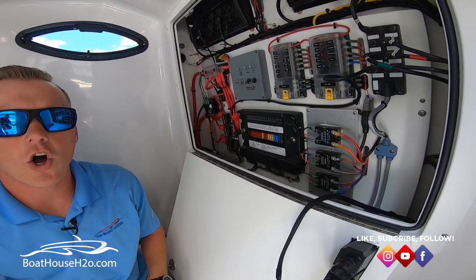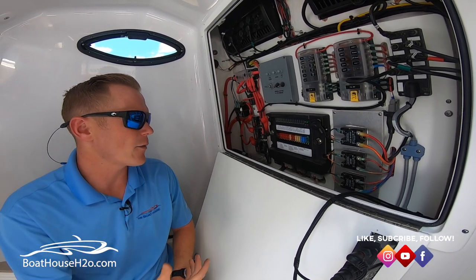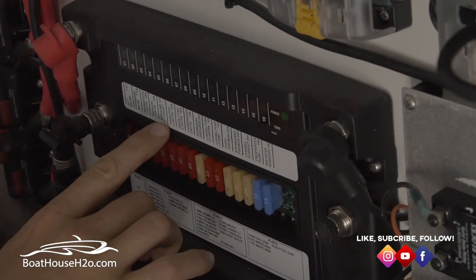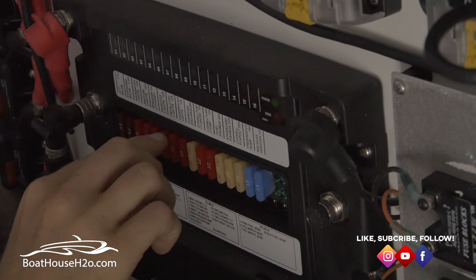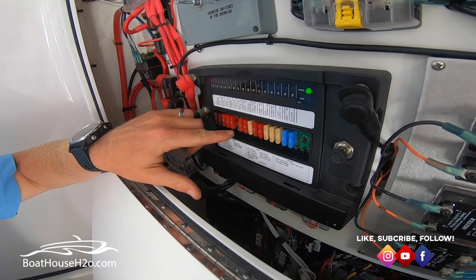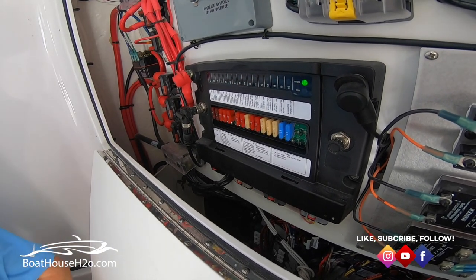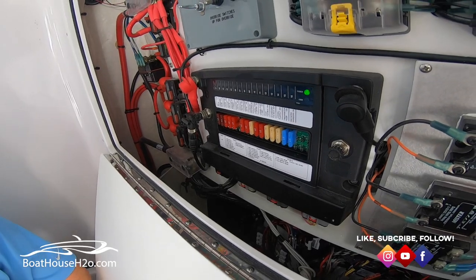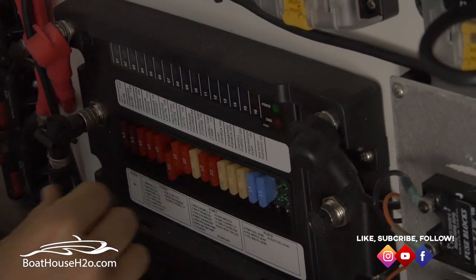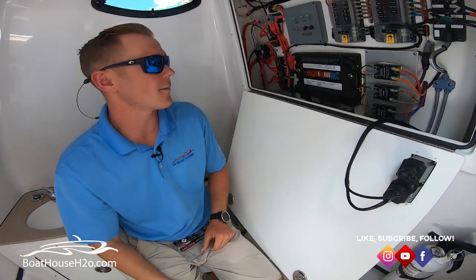Down below here, as you can see, you've got this Maximus DCM by C-Star. What that is is all of your switches that you see on that panel right here. So for instance, like we were just talking about, the hardtop lights — you find hardtop lights right there, go down to your fuse below. If you pull it out, there are actually three pins inside. If you have it set up to be controlled by your switching screen above, it'll be on the top two pins. If you want to manually override that and turn it on, just go ahead and put it in the bottom two pins, and now your LED overhead lights are going to be on.